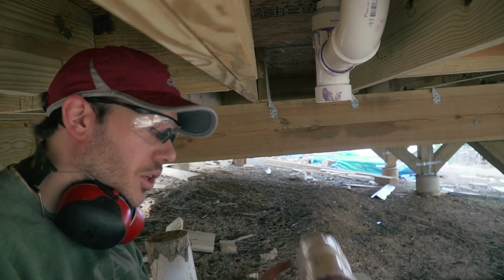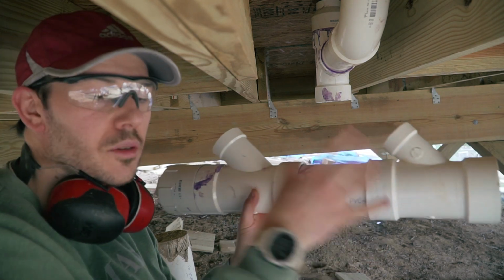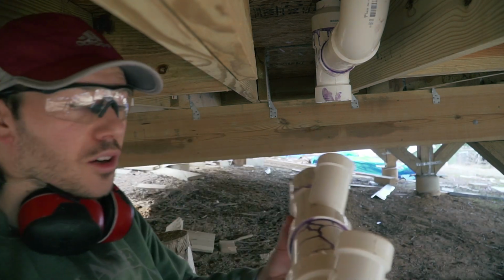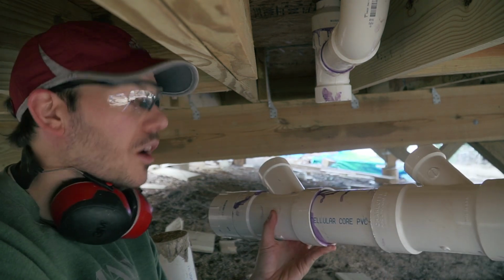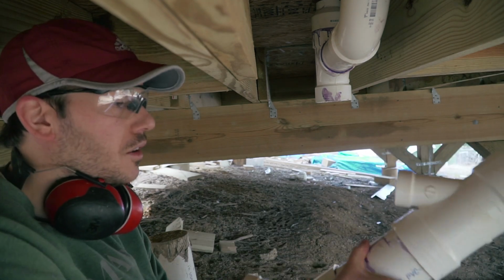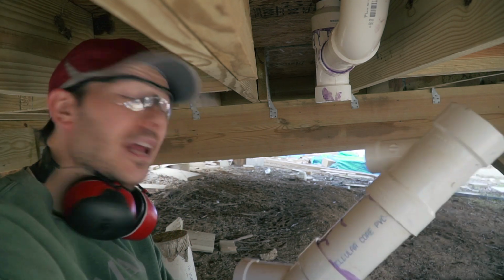Here's a life lesson for you. I was trying to fit everything dry, but obviously you can't get everything in when it's fully dry. It won't go all the way in. So I was like, you know what? I'm just going to put the primer. It's going to help lubricate it and it will fit, which I did. And then everything was fitting correctly. Absolutely impossible to remove this thing now that the primer is on, which maybe is common knowledge, but I just didn't know. So I tried everything to pull it out, soap and water, hammering it out. This thing will not budge. To the point where I'm like, why do we even put glue? Because this is not going anywhere.